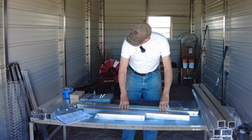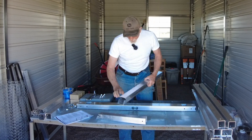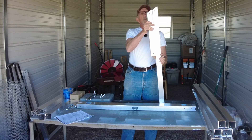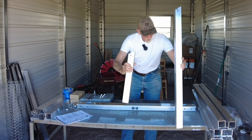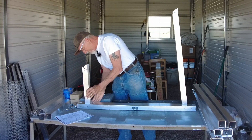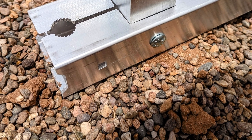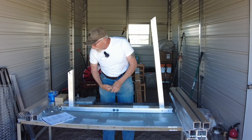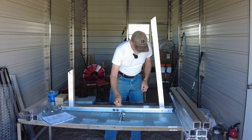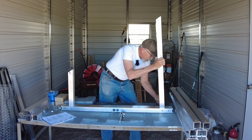We're ready to assemble. We've got three pieces on each leg of the IR-30 frames. We have these two pieces of aluminum — make sure you have the direction going the same way — then just drop in one piece and drop in the front one. The bolts here are M8 1.25 by 90 millimeters and they take a half-inch socket. I have the tools ready, so let me get all of these assembled and then we'll start laying them out on the ground.